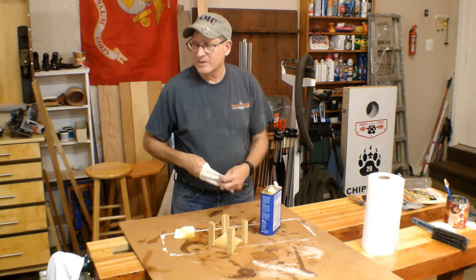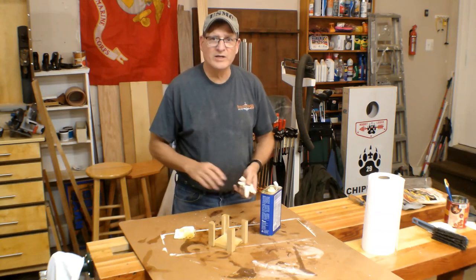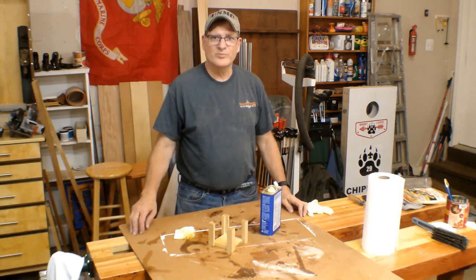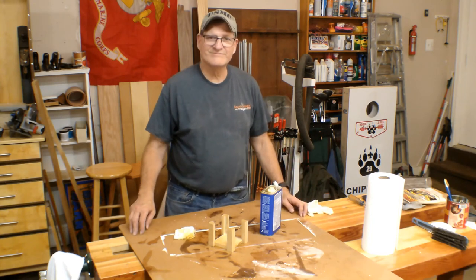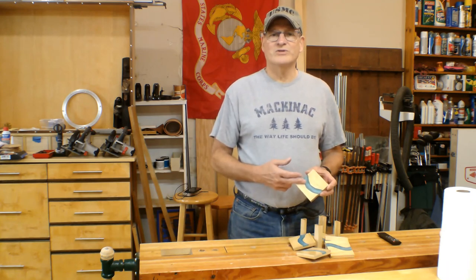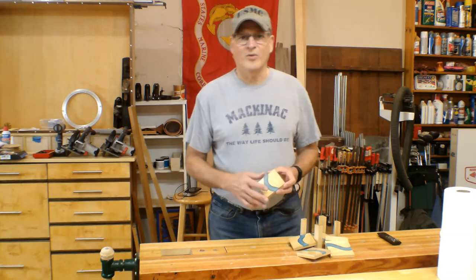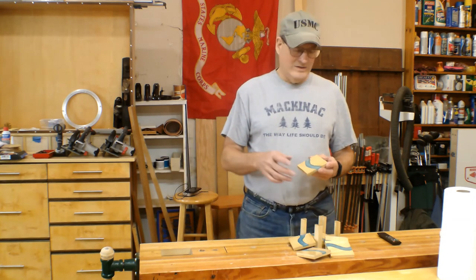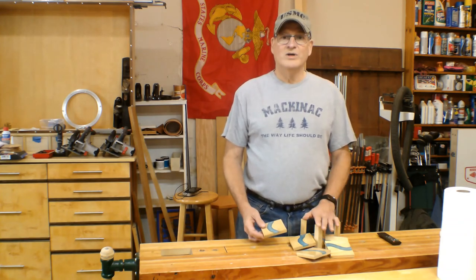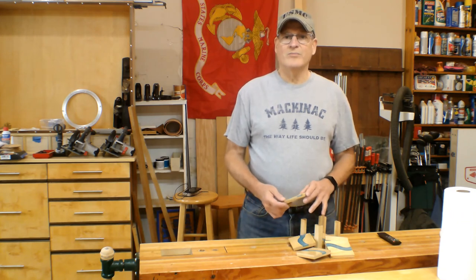By that time, I think the additional coat of polyurethane on the coasters will be dry, and hey, project will be ready to rock. Project's done, finish is dry. I have three coats of polyurethane on the coasters, which will protect it against all manner of water and coffee and whatnot. These will last a pretty long time. I put two coats of BLO on the carrier, which is perfect for that because it's not going to see a lot of moving or handling.